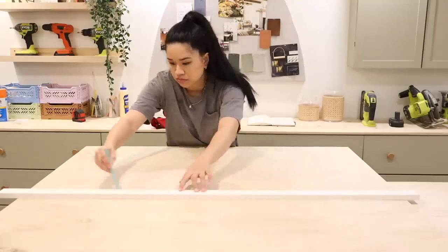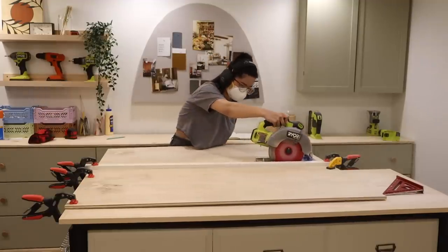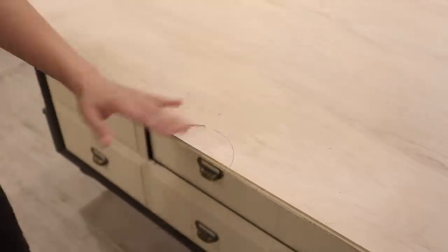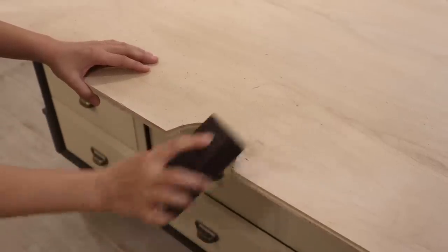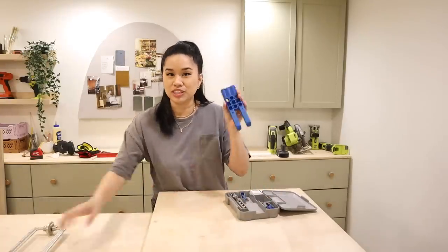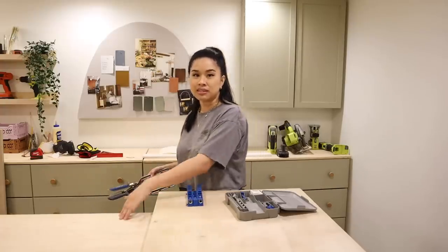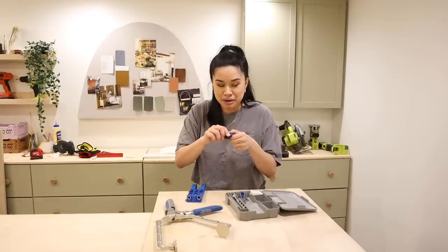This shelving system is going to be a little bit on the taller side just to utilize as much space as possible in here. Essentially it is a simple bookshelf slash cabinet. Each of the shelves are just going to be six inches apart and everything is going to be held by pocket holes. For the top I had to add a little notch on the side to fit that awkward pipe in the corner of the closet, and then I added a half-round opening in the center on the back for cords. This is going to span the entire area of the closet and serve as a tabletop for things like our printers and other office items. I'm going to pocket hole all of these — I saw someone clamp the jig to the wood piece instead of on the tabletop, which I think will make my life a little bit easier, so I'm going to try that.